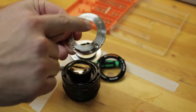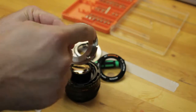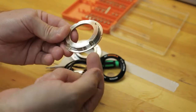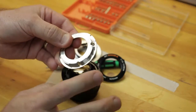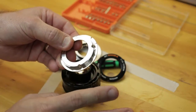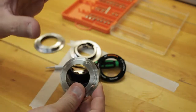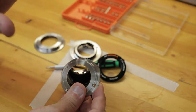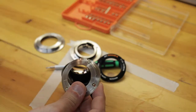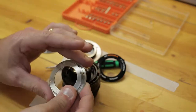if you can see here, cut out half of this bayonet lip area because of where the holes came through. That was the most difficult and frustrating part. With various Dremel bits on high RPM in the drill press, and let me just say that this part of the whole process so far has been the most difficult. Getting them to line up with the holes, getting nice smooth cut, even though it's soft material.